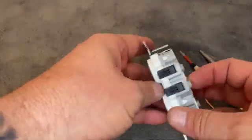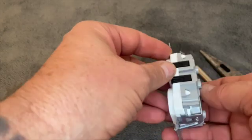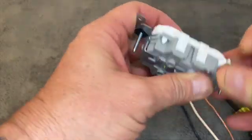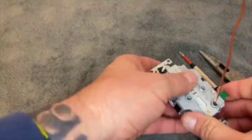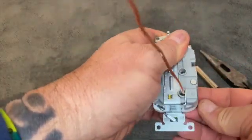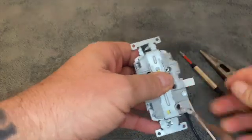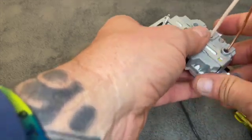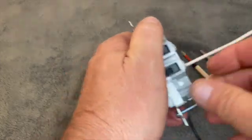Taking a deeper look at this new Edge — there are no terminal screws exposed on either side, your neutral or your hot side. Your ground also has no terminal screws. To install the wire, all you have to do is flip those out, come in the back, stab it in, and listen — you hear it clip in. Take your neutral wire; notice how it's color-coded — the white wire goes into the white terminal. Listen for the click. Pull on it and you know it's secured in there.